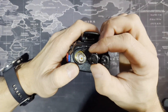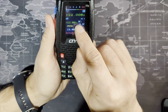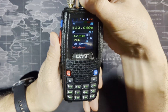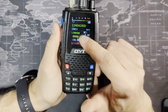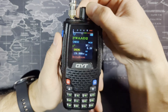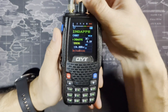Let's talk about this knob. This is the channel knob, which is very convenient if you don't want to use the arrow buttons. You can cycle through the frequencies in 8.33 kilohertz steps — the knob does the same thing within that step range. It just continuously spins with no limit. Once you exceed the number of channels you have saved, it'll just cycle back to the beginning.